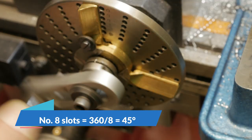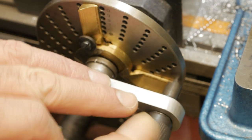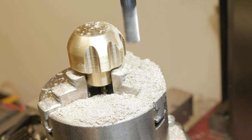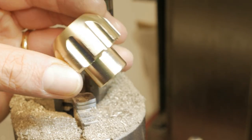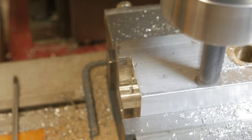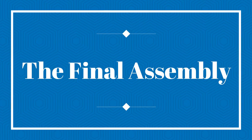For making the knob, I use a 20 hole disc, making 11 turns and 5 holes for each cut. The ratio of my dividing head is 1 to 90. After making the M5 holes, I made some exterior finishing work before the final assembly.